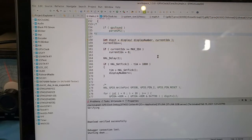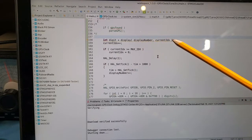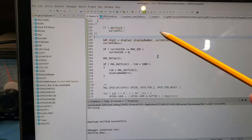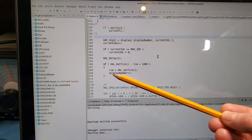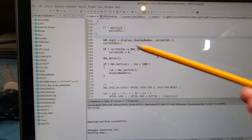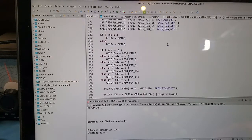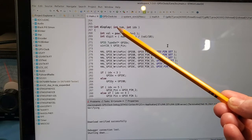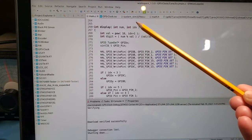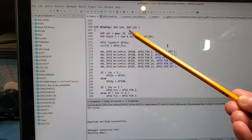Let's go over to the code. Here's the main loop of the STM32F4 and it's really quite simple. I call this display function; I have a display number and a current index — the index is basically which digit is currently lit. I simply iterate through this, and then if a second has elapsed I update the display number. A clock obviously needs to be more complicated than that, but this gets us going. The display code: I pass in the number to be displayed — starting as 1 2 3 4 5 6 — and this index gets updated every refresh interval.